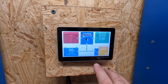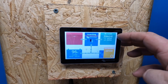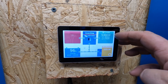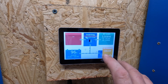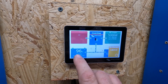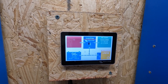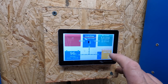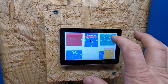You can see here the panels are putting out 2,300 watts. Now the car just kicked in and it's ramping up — it'll usually go up to around 5,000. All right, 5,300 watts is what the car is requesting from the batteries. The panels are putting out 1,800 to 1,900 watts; it's kind of a cloudy day today. It's actually pulling 4,200 watts out of my batteries right now. So essentially, if I wanted to charge the car for a few hours, it's going to drain my batteries. The panels will put out whatever they want — the idea is that when the panels are producing, that goes right into the AC load.